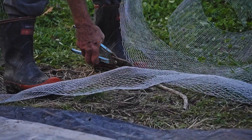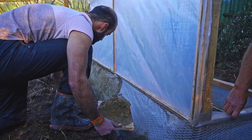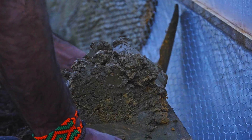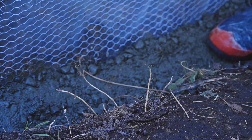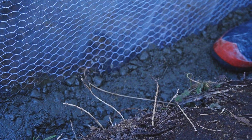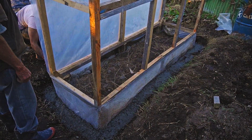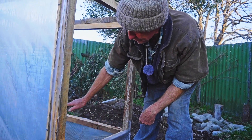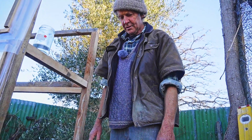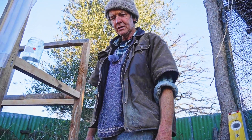Daniel is plastering into that netting with a pumice cement mix, so that'll go quite hard. Then down the bottom of the skirt, which comes out at right angles to the wall, we've got some builders mix and cement - concrete in there that's good and solid - and that's going to stop them digging down and underneath. So that's our rat skirt. That'll provide us with a retaining wall right around that we can fill with a dry mix of topsoil. The dry topsoil gives us a reasonable amount of insulation - not the best, but once it's dry it's reasonably good.